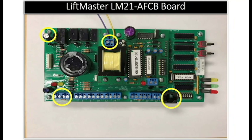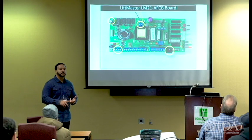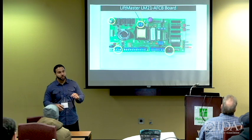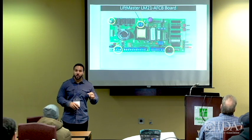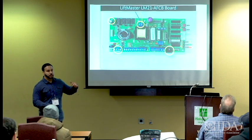I gave y'all the whole structure and breakdown of it, to where it actually is the brain and the motor is the body. And when you combine them, you have a totally automated reset system, okay? So it's a total automated reset system, meaning that it can stand alone or it can be tied to the central building alarm system. The same way though, it must be in compliance with a relay module, or the alarm system must put out C-form dry contacts, normally closed or open, that go to the circuit, and then we can conform.